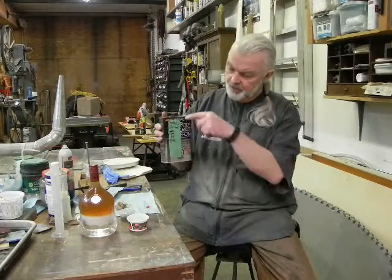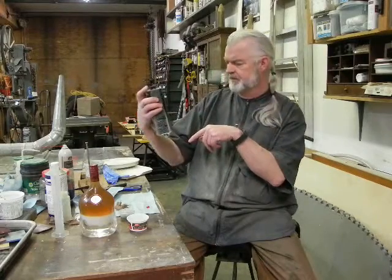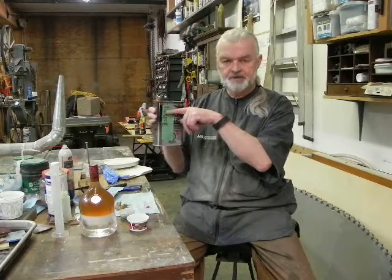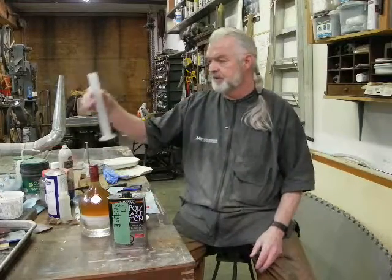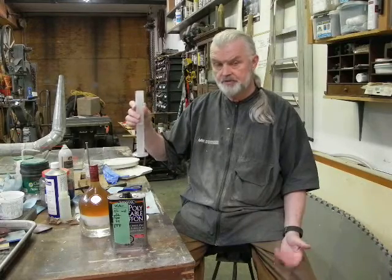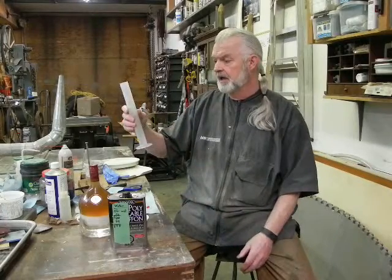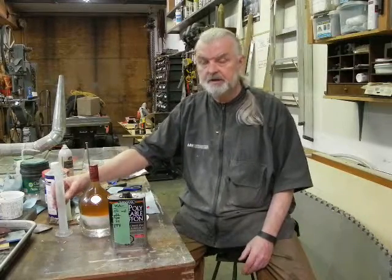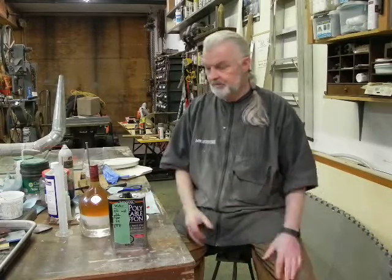So now what I do is I pour it in here, I measure how much water I pour in, and I write it down. So obviously when it's full, it's 940 mils. When I get to like 850 or 900 mils or something like that, I think I'll shut it down. All I do is use a little graduated flask, so I know how much I put in. It doesn't have to be a graduated flask. As long as you can measure how many mils you put in, or however many ounces, depending on the manufacturer, and then write it down every time, you know when you're starting to get close to the bitter end. So, just a couple of little tricks.